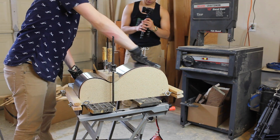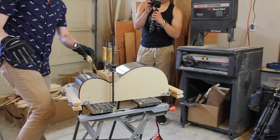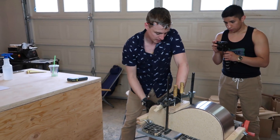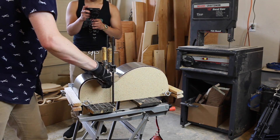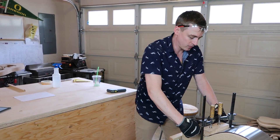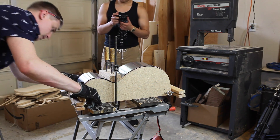I just got the lower bout down pretty tight on the curve, but it looks like the upper bout popped up a little bit. So I'm going to unclamp it, smooth it back down, and reclamp it so we're tight on the curve. I'm really not sure how much spring back this is going to give me — I've done some steam bending before and there's a lot of spring back. I'm not sure exactly how to fix that, but we'll figure it out as we go.